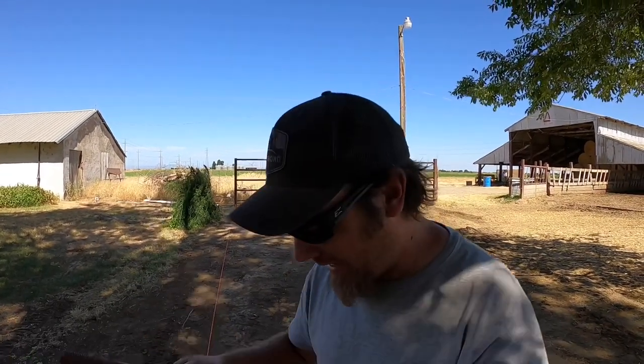Now that I have all my marks on the ground where my posts will go, I do another step here that I'm not sure everyone does. I think this is something that I kind of came up with. No one really showed me this, but it helps make digging these holes with a three-point digger by yourself a lot easier. What I do is I take a pin, or in this case, a big bolt, and I will pound it into the ground right where the post is gonna go,